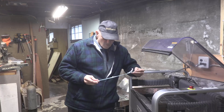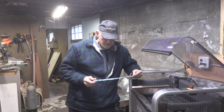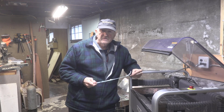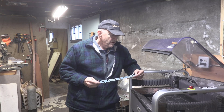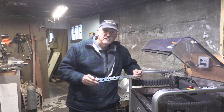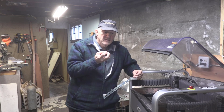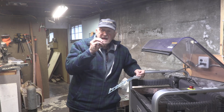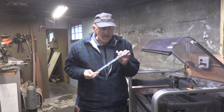I'm going to blame it on the material. Well, it's been about twenty-four hours since I cut this, and I've had an opportunity to do a little bit of research on this material and what's likely going on. The first thing we did discover is that the manufacturer says this material is not recommended for cutting operations with a water jet. The reason for that is that as the water jet punches its way down through the material, the water pressure right at the point of impact is extremely high — on the order of thousands of PSI — and that can actually burst the bond between the laminations, which is obviously what happened right here.